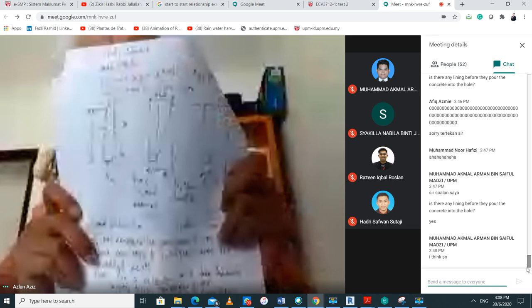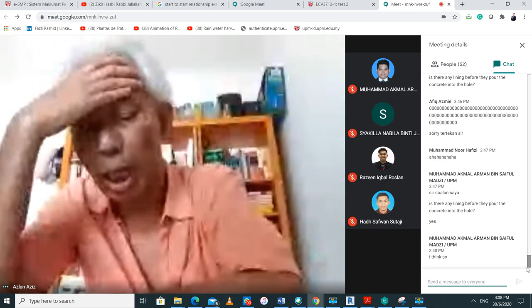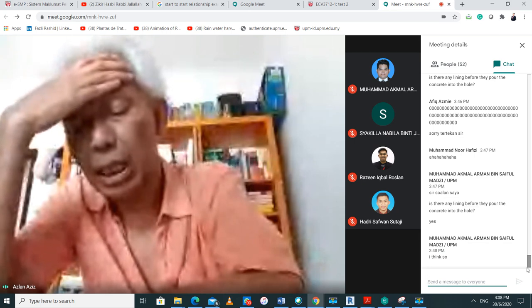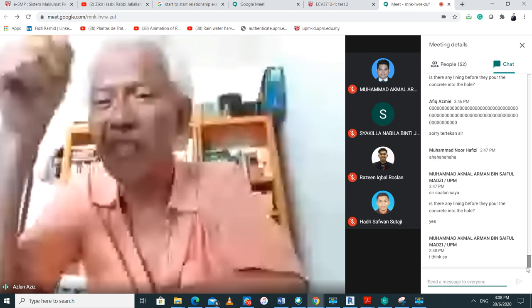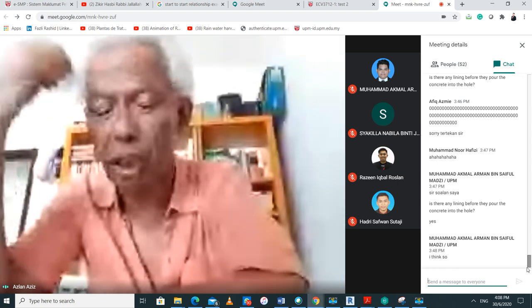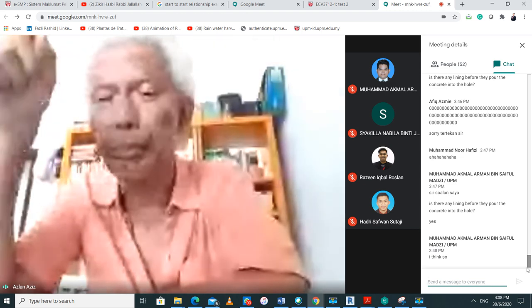So the ultimate load in equation one, it says Q out. This is a load, which is a force, right? Ultimate load in kilonewton or newton is equal to pi B D multiplied by F sub S plus A tip multiplied by Q sub U. Remember, just now when I showed you that picture, the skin friction is F sub S, and the Q sub U is the ultimate bearing capacity, whether circular or square in shape, which you learn in shallow footing. Then the second component is Q sub U multiplied by A tip.